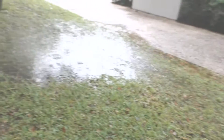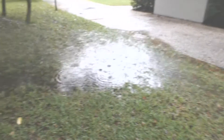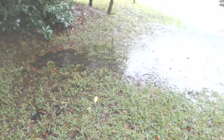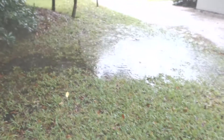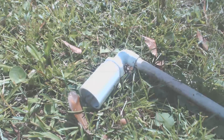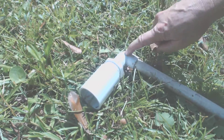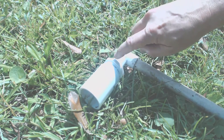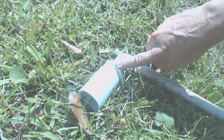The far less expensive method is to use a water level. Follow along and I'll show you a solution that shouldn't set you back more than about thirty bucks, and this one uses PVC pipe, is easy to build, and very simple to use. The ends are half-inch PVC elbows, a short section of half-inch PVC pipe, a half-inch to inch-and-a-quarter PVC bushing, and a one-and-a-quarter inch PVC coupling.